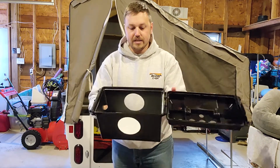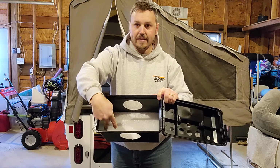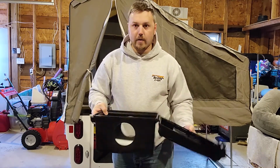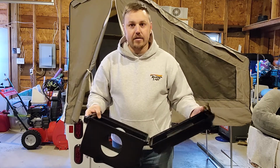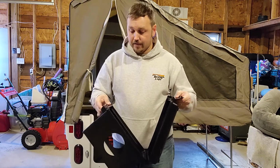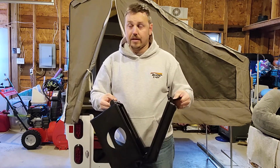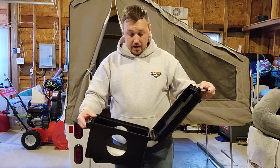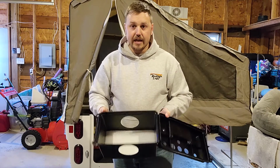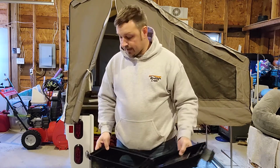What this will do is this will hold 2 batteries, one at this end and one at this end, 12 volt, 9 amp hour lead acid batteries are what I'm going to go with. I don't need the real long duration of the lithium ion or there's another one, lithium phosphate, I think it is. But by having the 2 batteries on each side, I'll have 18 amp hours at 12 volts. That'll be plenty for a long weekend.